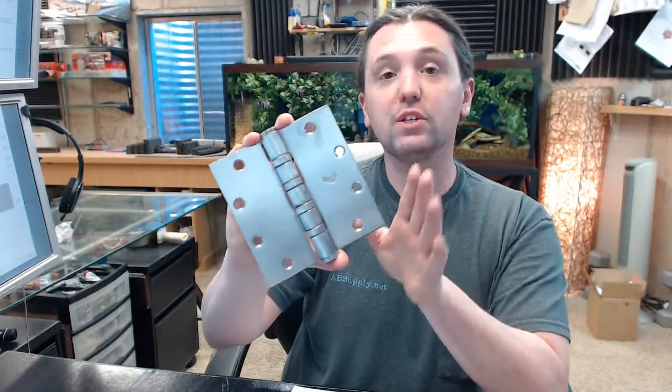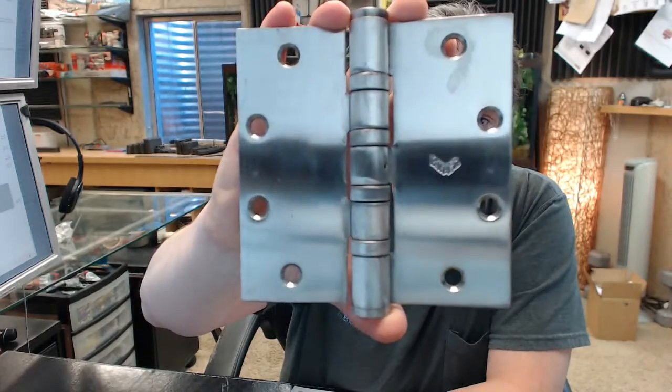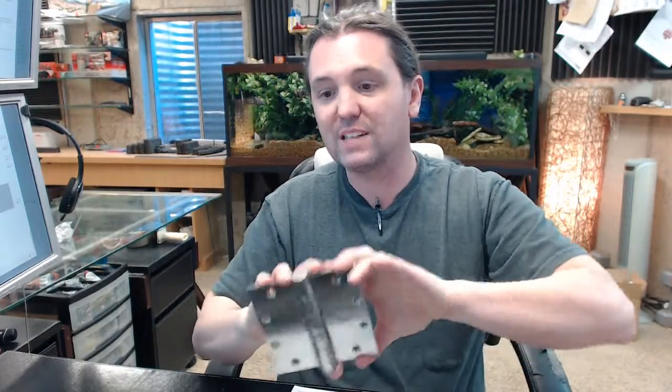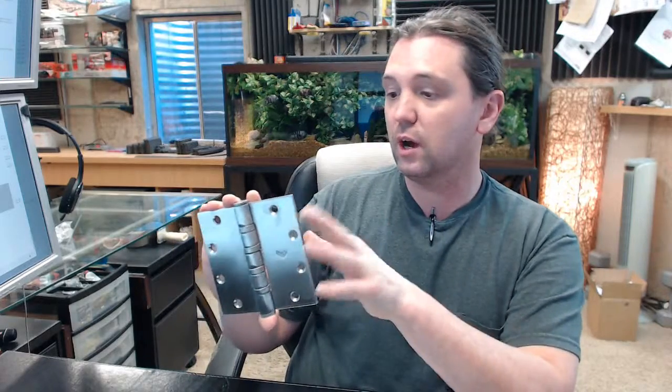This will also give you 32D, and that means two things. That means, first of all, that this is a satin stainless steel finish on a solid piece of stainless steel material. So it's a great hinge for lots of applications. My current one is a 4-foot, 5.5 inch wide, 16 gauge hollow metal door. That's going to be a vault access door for the electric company. Door is not going to be used or open that much, but when it will get its use, it will be used often. The hinge is intended to be robust enough to allow several years, if not longer, of expected, predictable sort of life service.